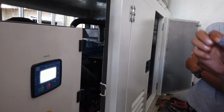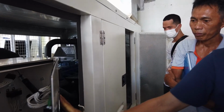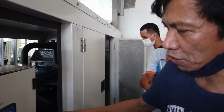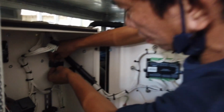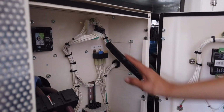When this one is defective, the scenario was, you do the cranking, but you don't crank. We do 3 attempts until the fault, same, EO 65. I just don't want to do it many times because it will discharge the battery. You can check the fuses. That's what I was asking the engineer, how to dismantle them. Yeah, just like automotive fuse.